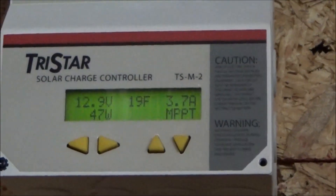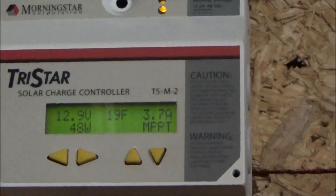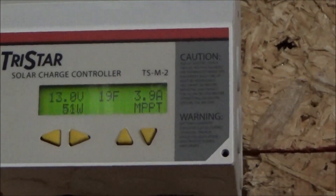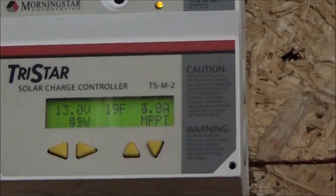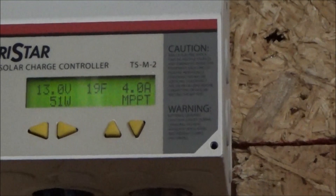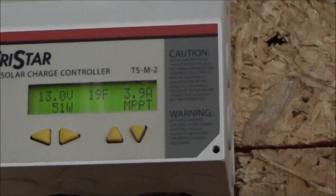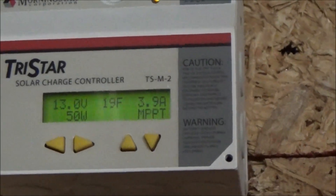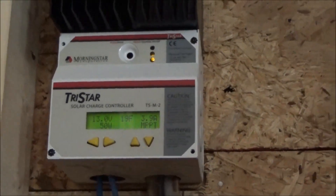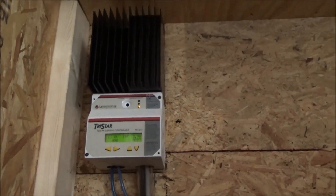I'm going to go out and see if I need to sweep the panels off — I might be able to improve that a bit. It is going to get cloudy today and we'll get more snow, so I'll enjoy what's coming in while I have it. These batteries show a very high voltage under very little charge — less than four amps coming in. They are sulfated and in absorption mode, not taking much charge. They're going to need to be desulfated. The good news is my reconditioned forklift battery bank is on its way and will be delivered today.